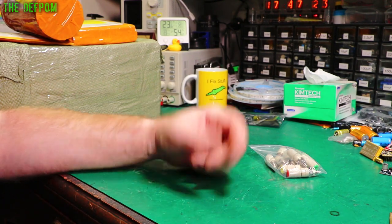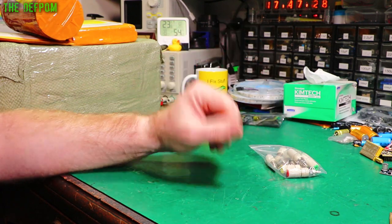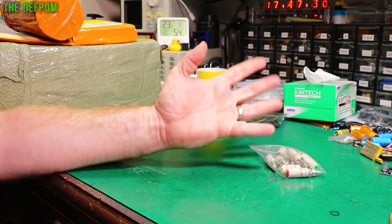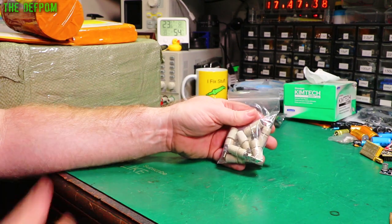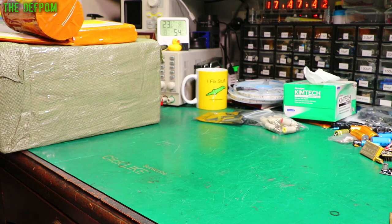So doing this conversion is a better way to go. I'm not going to do that on my 7061 — I'm going to do the 7075 instead, because the 7061 is what I'm keeping and I'll keep the cable I've already got. I'll use an assortment of these — I need five connectors, one of each colour — and that will be suitable for positive, negative, sense lines, and guarding. Winner. I'll probably do a video on that. There are links down below for all these things — nice connectors, much better than the last ones I checked out.